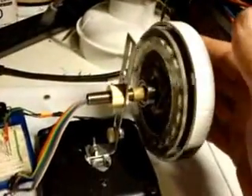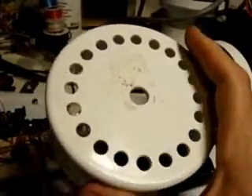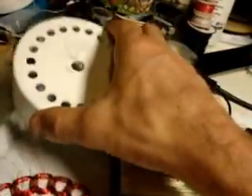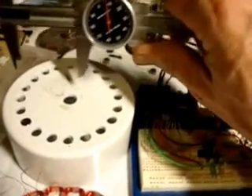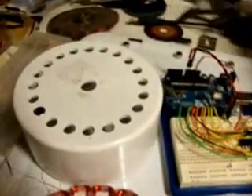This whole thing has been designed to be easy to make. It's made out of plumbing parts — this is originally a cap from a four-inch drain pipe. I didn't need to have a lathe or anything to put the holes in it. I used a stepper drill and just kept referencing it on either side. As I step the drill up into higher diameter holes, I can kind of guide it. These things are fairly easy to make.